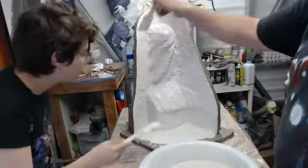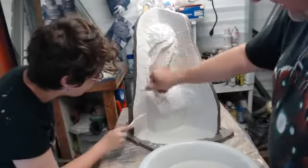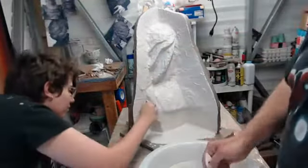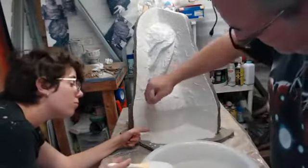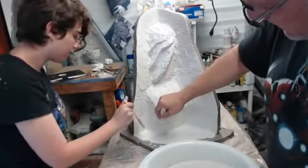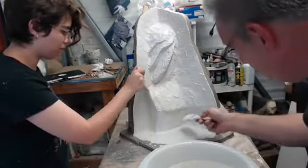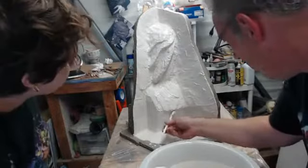What I'm focusing on is that it started going eggshell. Yeah, the eggshell is kind of an enemy, because that means you have to work faster. But you're constantly watching for air pockets, air bubbles. Water, you can just add a little more in there. You are going to get some drainage. It's almost like the material you're putting on there is sweating a little bit. That's normal, but you may have to adjust your material.